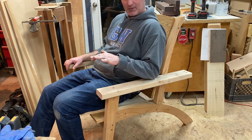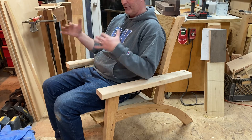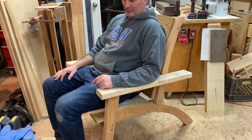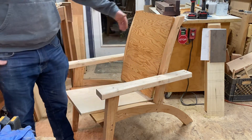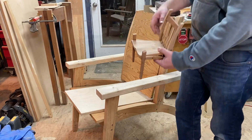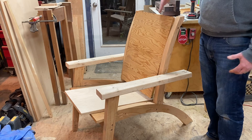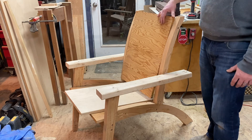I don't know if adding that additional three-quarters of an inch has done much for the comfort of my legs, but I'm really sensitive that when I slide something like this in, it also has an effect on the rest of the proportions. With adding that in, these armrests feel a little too low — I have to search for them, which is not great. So I think the height where I had the original seat is better. This extension is helpful to gauge what the back of my legs feel, which is important. What I've identified is that this seat is obviously incredibly flat, and with my models there's a little sweep to the back that's going to happen right here on the crest rail. I want to try that out at the mock-up phase — just to see what a little sweep would do. Then I can put curves on the backside vertically and see how that compresses to that shape.